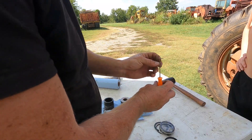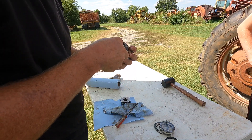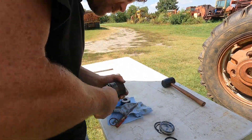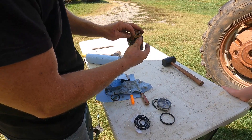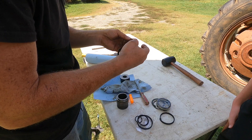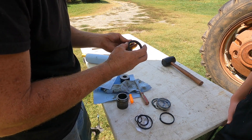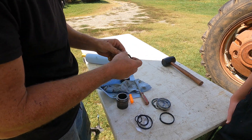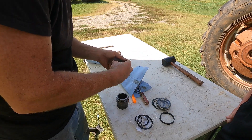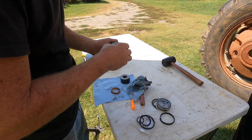I'll pick those out. See how that one's kind of curved? They're just meant to go in here - poke these out. That's what that is, and it's disintegrating. If you put this in backwards you're screwed. It looks like it holds this way - looks like it goes in that way. There's some kind of flat face here. That looks like the side that holds pressure. Plus it's flared out - anything that flares out holds pressure. So I'd say that definitely goes in like that.